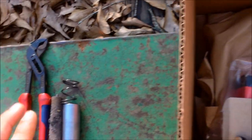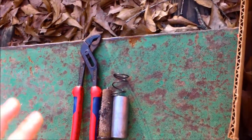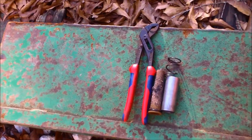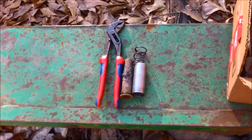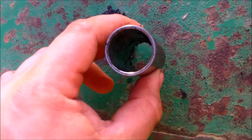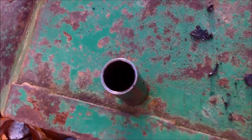We're going to take a little bit of brake parts cleaner and clean this sleeve, clean this, and go ahead and spray a little bit in the port to clean it out carefully. Some people say don't use brake parts cleaner because it will eat gaskets and stuff, but as soon as we turn this machine on it's all going to pass through the system pretty fast — it's good just to get any loose dirt and junk out. There are pieces of old O-rings down inside there — that could have came off a lift cylinder, which is why I'm rebuilding lift cylinders on this machine because one of them is leaking.